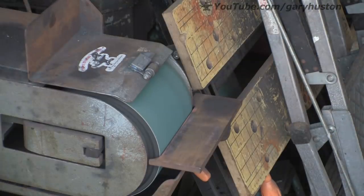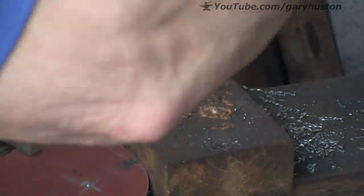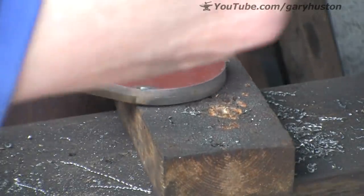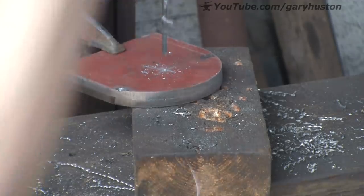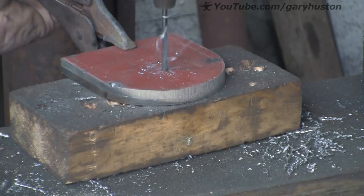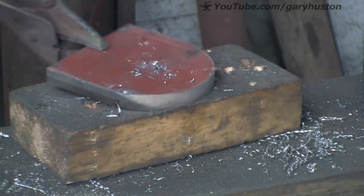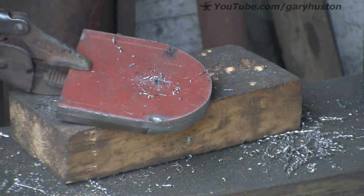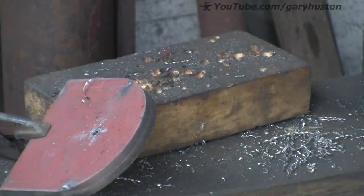Right, now we've got to put the holes in. I've marked them about the same dimension as on the other uprights — only about an inch and a half in. There's a four-inch plate so in theory, if you're doing it accurately to engineering standards, it should be two inches in. But it won't be tall enough — I need to gain an inch. So I've dropped it down to inch and a half. I've done the same on the other end, so the two half-inches are gaining me the inch. It might look a little bit odd but hey ho — it's only going to be me using it.